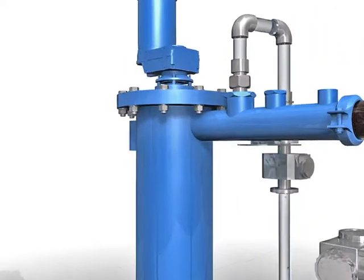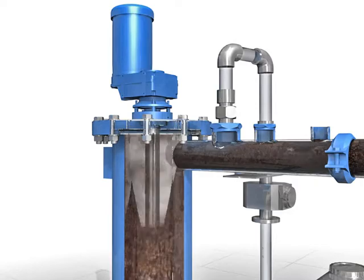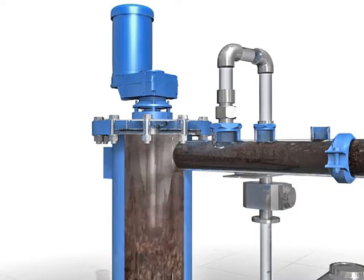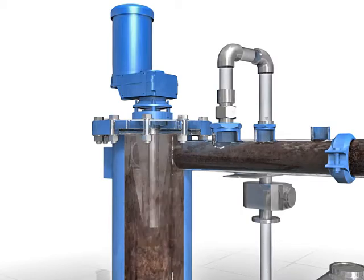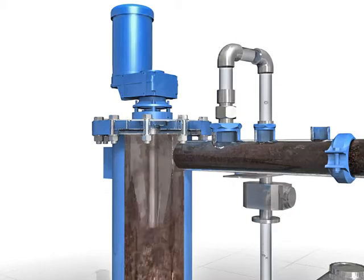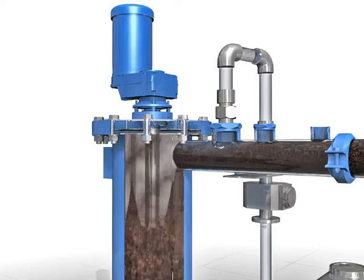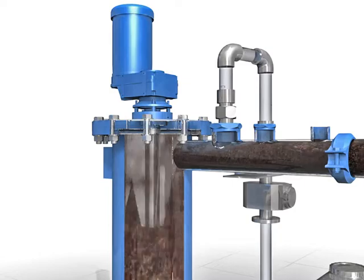The sludge pump feeds a flocculation unit. The flocculation unit is a unique device allowing a highly efficient mixture of sludge with a polymer solution, and most importantly optimizes the polymer dosage. The polymer solution is injected at the inlet of the flocculator. The flow rate of polymer solution is regulated to maintain a proportional feed rate with the sludge. Optimization is achieved by the special design and the variable speed of the mixer.